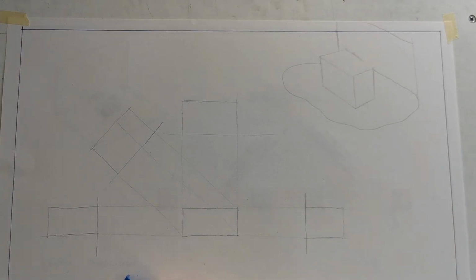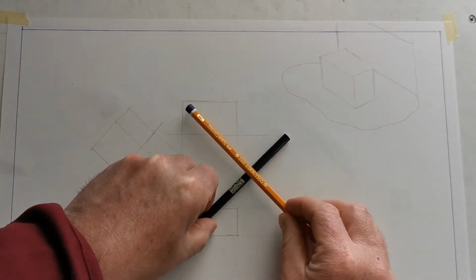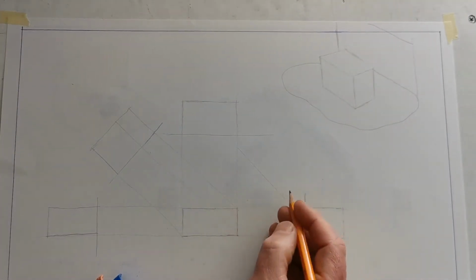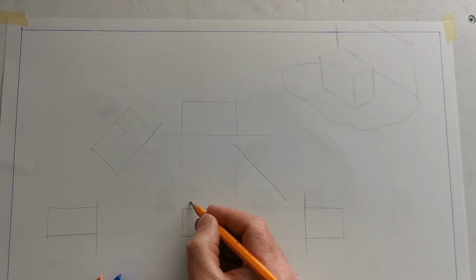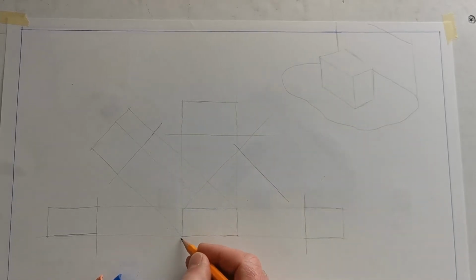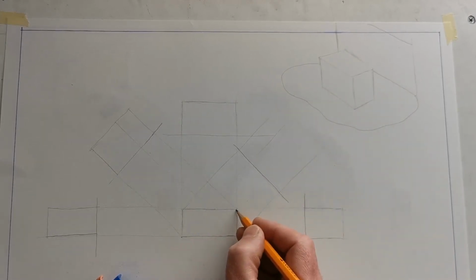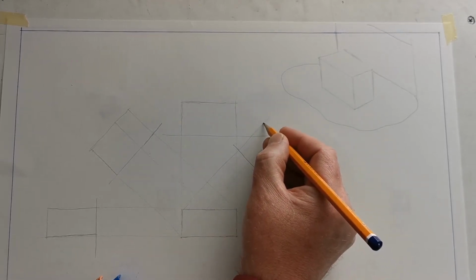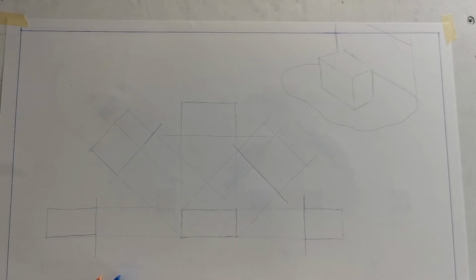And finally, one last auxiliary looking in diagonally from this direction. So again, that's the angle for looking. That would be 90 degrees to it. So this here roughly is the angle for the XY line, for the ground. And we're projecting up here. Here's the front. And here's the right hand side. Now note, I'm not bringing up the back because when you're looking from here you can't see the back. And this is about our height. So again, that's what I call a crate there.